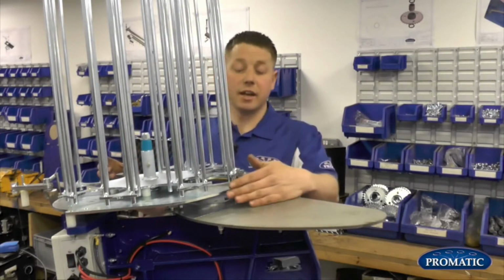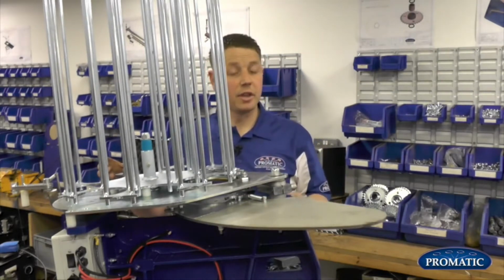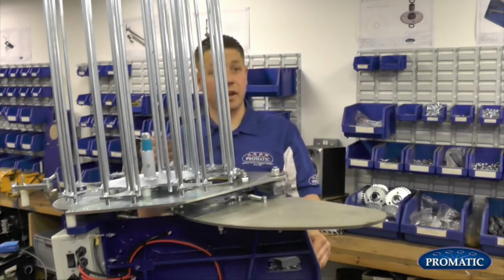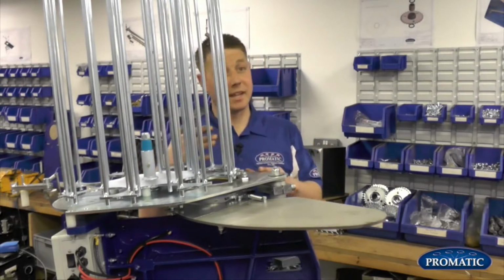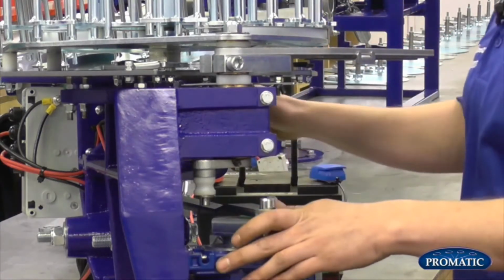If it's going over later, you're losing distance, or you press the fire button and you wait for a long time, then the machine releases. And basically what that is, it's gone over, and it hasn't gone over what we call top dead centre, and that's what's causing it to actually come off the arm a lot later.